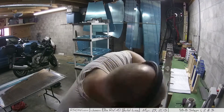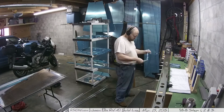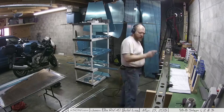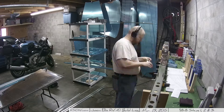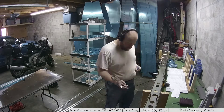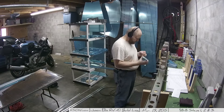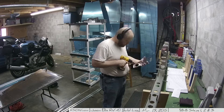And again nothing's difficult. A lot of clecoing bits and then match drilling all the parts and going from there. And here you see me pulling the bluing off of four other pieces that I didn't realize I needed because I didn't fully read the instructions — I talked about that in the last video. So I have to kind of go back a little bit, deburr, and get those ready to go.